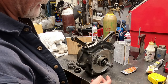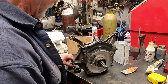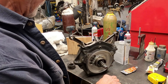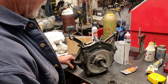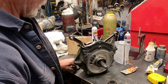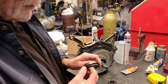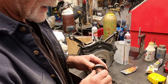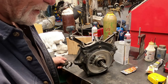What I did is I pressed in new Timken bearings. Now these are the old ones — this presses against the flywheel. And then you have a spacer that goes in between and the other one is pressed on this way. I also replaced the races and everything. They were in pretty good shape, but I just wanted to take it one more step to make sure that everything was good.